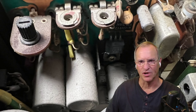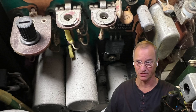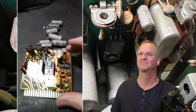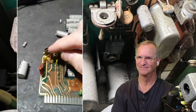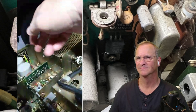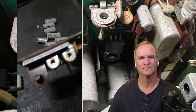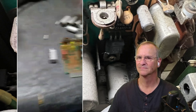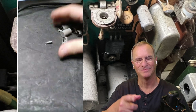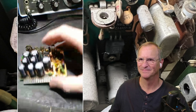When I first started talking about this radio, a couple of people reached out and said make sure you change out the capacitors on the regulator board. Of course Paul knew to do that. There is your regulator board — there's all the electrolytics and the mylar that need to be replaced, including that brown one. That's the regulator board — that is where your bias, your voltage, and all that is. I just pulled them off the board. Now the after: there are all the caps — there's your new board. Looks nice. All new electrolytics.